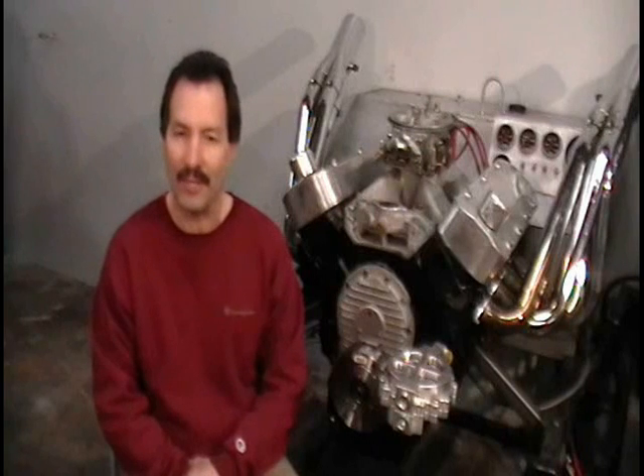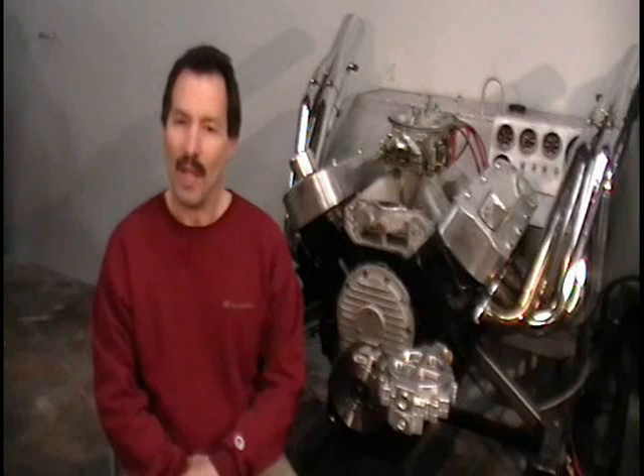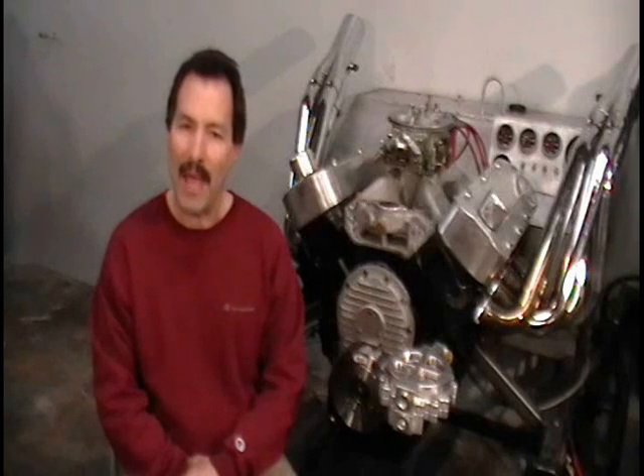In racing, aftermarket filters have helped a lot. They've made filters that we can take apart, examine the filter element, clean it with solvent or brake cleaner and put it all back together and run the car again. This was a great way to decide whether there was a problem just starting or if the motor should not be ran again. The problem is that every time you needed to check the filter it was usually when the car was very hot, hot oil would drain out, run all over the car and the ground, and it took approximately 20 to 30 minutes to do this.